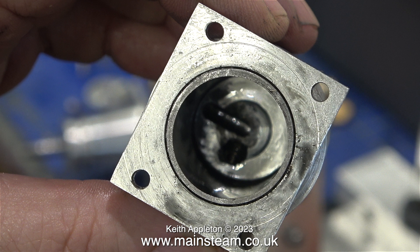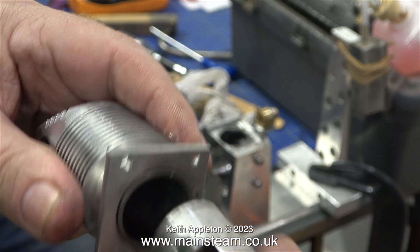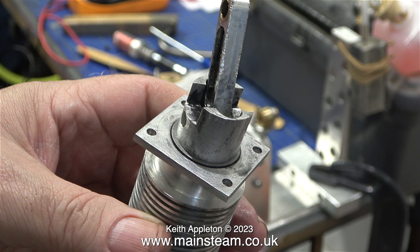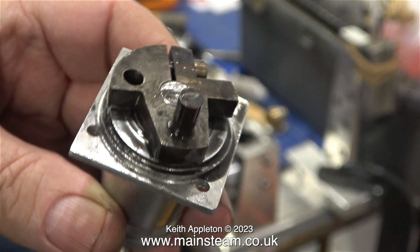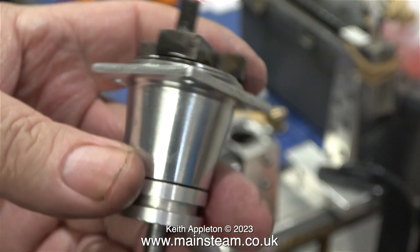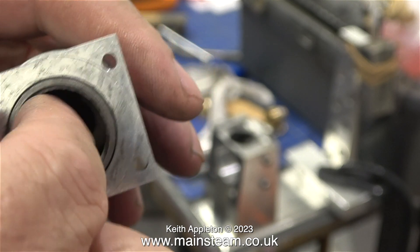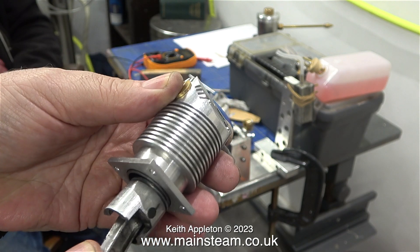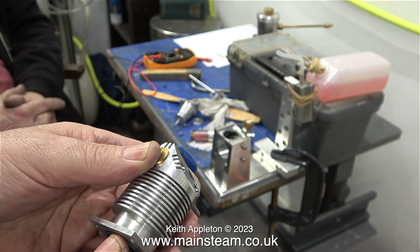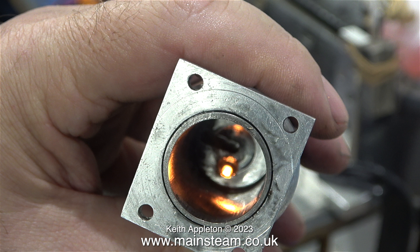That's good — we can rule the liner out of the list of problems. The piston fit is exceptional; Andrew's piston fits are remarkable. I wonder why the connecting rod is so beaten up — I meant to ask Andrew but forgot. To say this ring is tight in the bore when fitted to the piston is an understatement. However, when I tried the piston ring fitted into the liner on its own it didn't feel tight at all. Trying the piston in the cylinder without the ring, you can hear a pop when it's suddenly pulled out — it's quite a good fit.